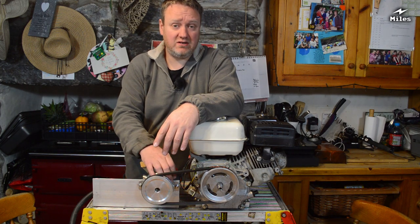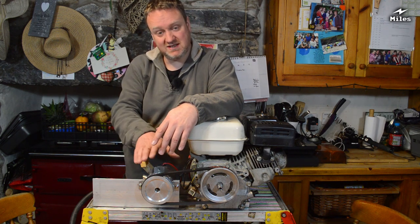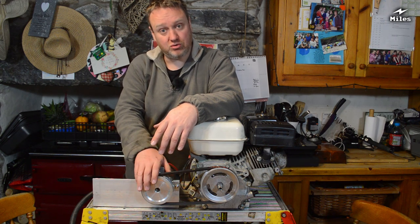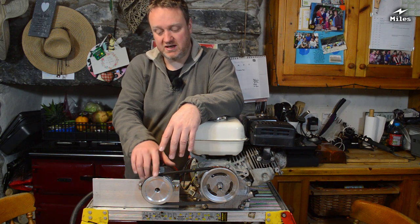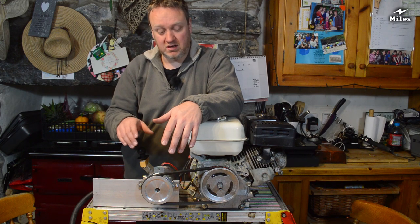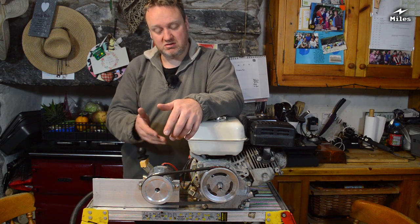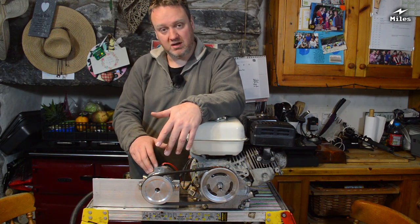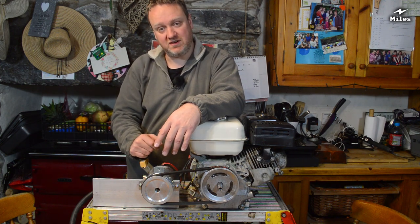You're going to get a lot more charge, a lot quicker, for a lot less fuel. You can also connect it directly into an inverter to get AC mains out of it. Another cool feature of using a DC motor as your power generation source is that you can actually use it to start the engine. If you connect this to a battery, initially with the engine not running, the power comes back into the motor and spins it to start the engine. Then as soon as the engine is running, it speeds up and the power flows the other way — from the motor back into the battery. It's all automatic and quite satisfying to watch.